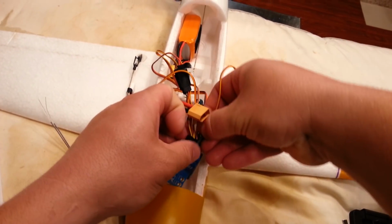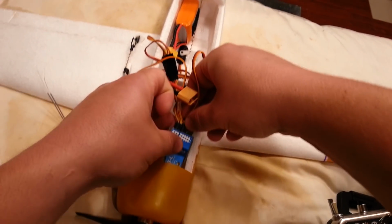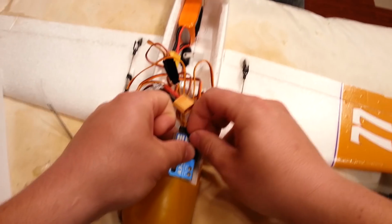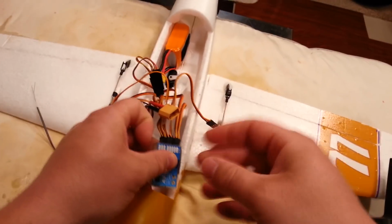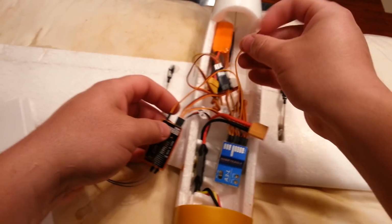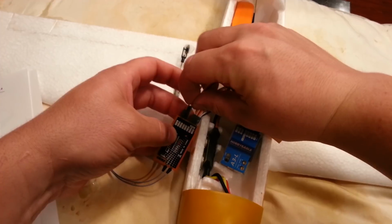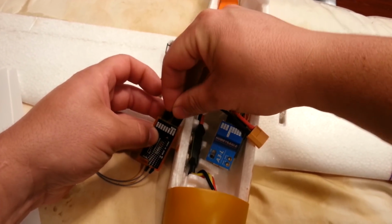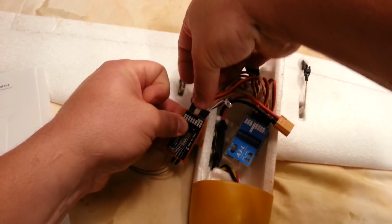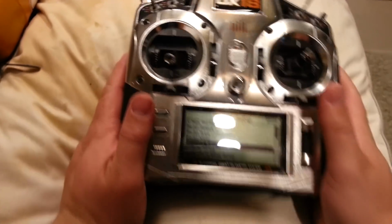Now you guys are starting to figure out why I go with the Lemon RX just by watching this. And you'll be surprised, this stabilizer works great. But it doesn't support flaperons. Immediately there's a strike against this one. Similar price point. But this thing does a really nice job of stabilization. Okay, so we'll just go auxiliary 1 for this one. Okay, so auxiliary 1 is going to be our mode selection in this case. Auxiliary 2, as defined by these positions on the Redcon receiver.